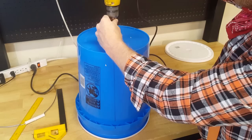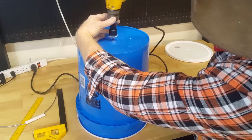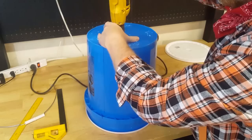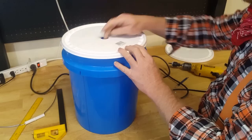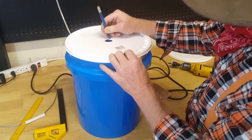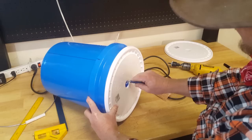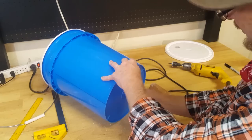Now we've got a reasonably well-centered hole. We're going to flip it over and do the same thing for the bottom side. Now I know it's not going to fit through the shaft — there's always just a little bit extra. So what I'm going to do is take my exacto knife and just kind of peel off a little excess to take a few thousandths off to get it centered up. Do the same thing with the backside too — just peel it off and then we'll be ready to mount it onto the shaft.